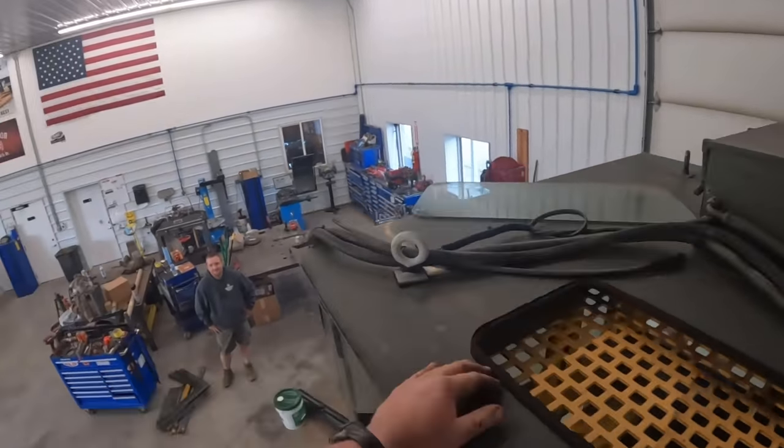So the other side has a bucket rod indicator over here. There's usually supposed to be marks painted on top of the cylinder. It will tell you where your return to dig is. It also has a couple for scrape and clamshell and stuff like that when you're using the four-in-one bucket. But I got these bolts out. I gotta take this bucket indicator rod off there yet.